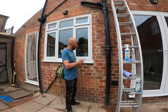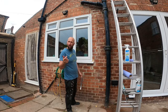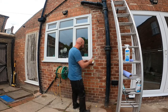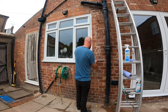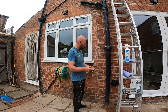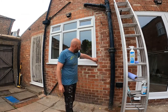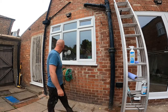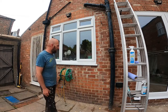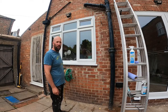Done the kitchen window, and what I want to do is try and tidy this brickwork up. So I'm just going to measure it, try and find a bit of brick, put a bit in there, and knock a bit of sand off the window. Measured. Basically, this bit should go in, so I'm going to cut it with the angle grinder so we can get it in, knock a bit of sand and cement up to go around it. Yeah, I've cut up a couple of bricks, not cemented in or anything yet, but a bit there, knock a bit of sand and cement up and just put them in. And then while I'm on, there's a little bit of tightening up to do underneath some of the window frames and stuff, so I'm going to get all that done next.